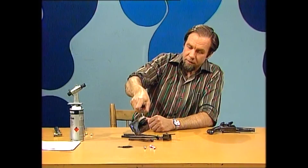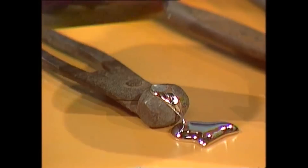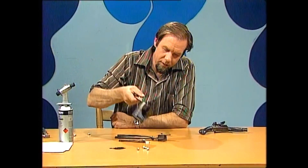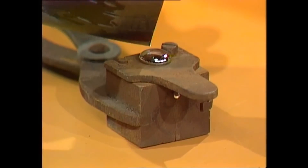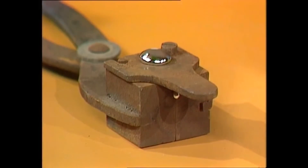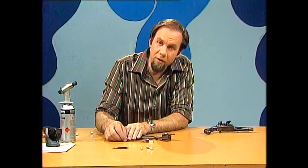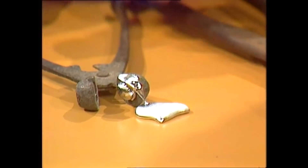The lead was poured into that hole there, and into this one. And if you keep watching that, you'll see when it goes from shiny to un-shiny — the metal has solidified. And then they had to wait for it to cool, and they could open the tong-like apparatus that was the bullet mould, and the bullet would fall out, like this.